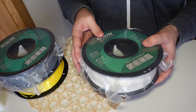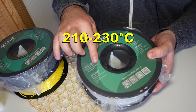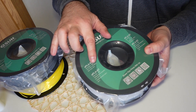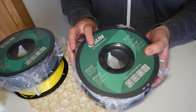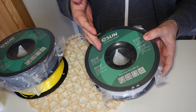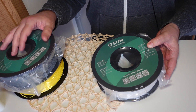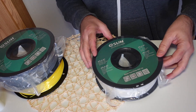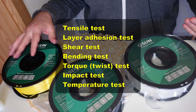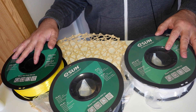The third filament in this test will be PLA ST. The recommended printing temperature is between 210 and 230 degrees Celsius, and interestingly the recommended bed temperature is only 45 degrees Celsius. I will print this at 225 degrees Celsius and it will be in white color. Only this filament was sent to me by ESUN, but this is not a sponsored video — I am not paid. These are my filaments and I will just do the testing and show you the results. I'm trying to build my own standards so the results are comparable across videos.